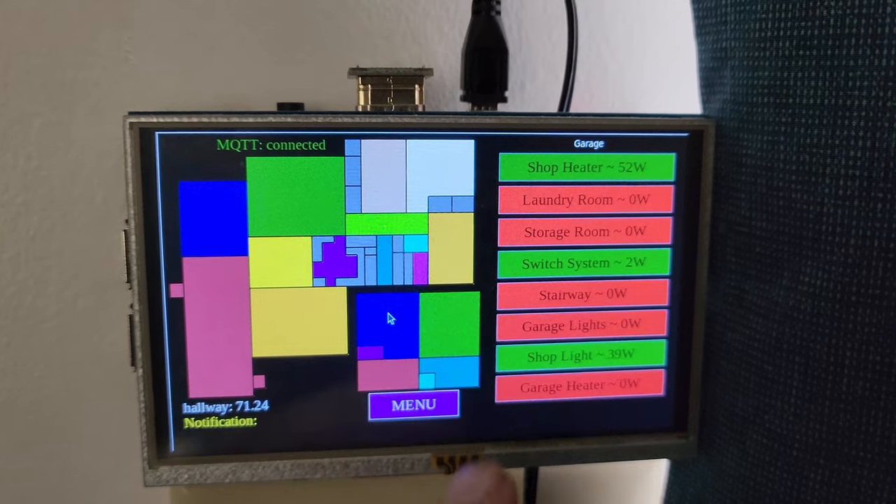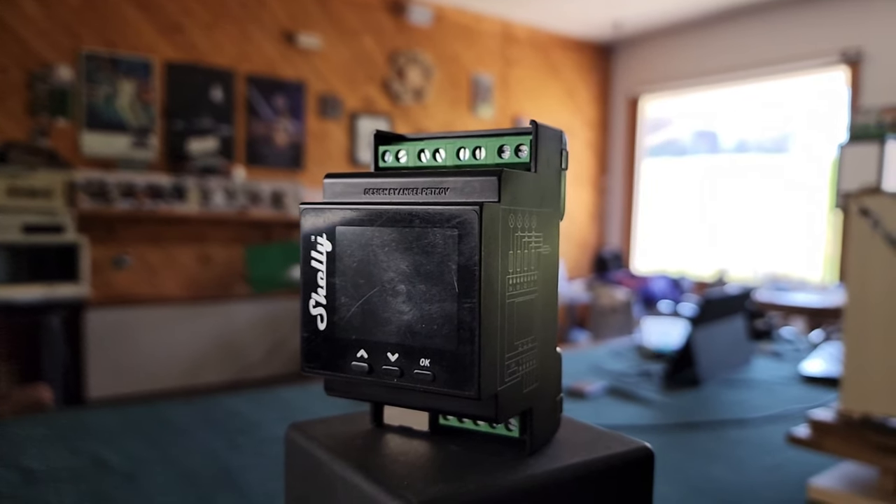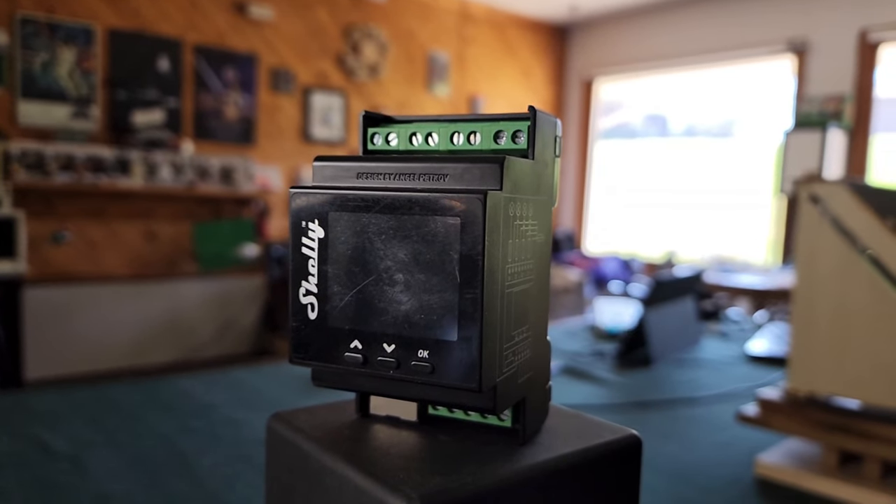Right now, everything my system does relies on my MQTT broker. The touch panels I've built send a command on an MQTT topic that the primary panel interprets and sends out another MQTT message specific to the control device. This is also how these Shelly i4 and motion sensor messages are handled. If the primary panel that executes commands goes down, each touch panel is capable of designating itself the primary until I can fix the one that went down. There is also a web server that can pass MQTT messages to this device which then sends the command over a serial connection to the isolated smart network. This is all great and secure, but it relies on two of my three Wi-Fi networks and I don't want the next person to have to go in and set up all the configurations when they take ownership of the system. The way I plan to accomplish this is with several Shelly 4 Pros which will replace all of these devices and provide a permanent network for the control system. I'll be adding one microcontroller that will be the brain of the more-than-a-simple-switch logic and I'll be documenting the setup and code for it in case it needs to be replaced later.